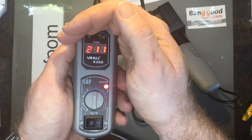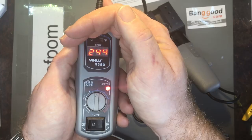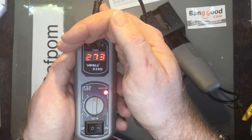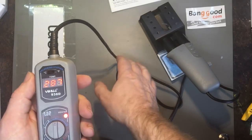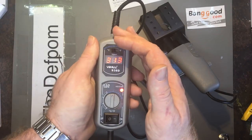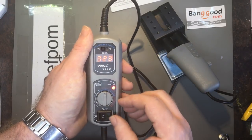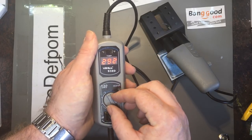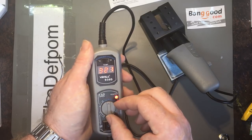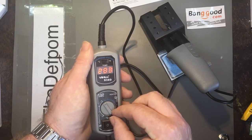It's topping out a little bit there — the PID is kicking in. Temperature is probably about halfway, so roughly 280 degrees or so. It can get up there quite rapidly and then as the PID control kicks in it slows down so it doesn't overshoot. I can smell it warming up — with a brand new iron you get the oils burning off. It's at 323 degrees set — the PID control works nice and gently.